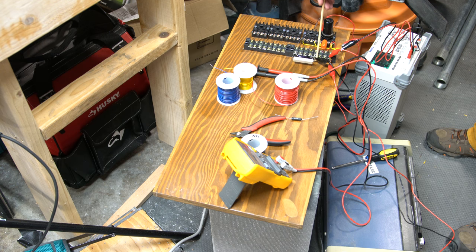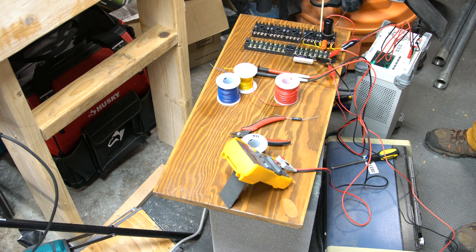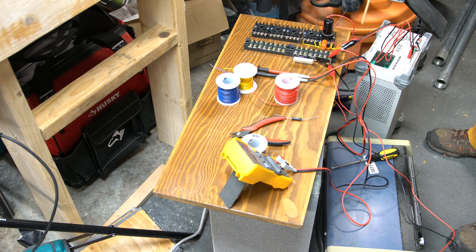I also have a capacitor connecting to the ground of the high voltage power supply. The high voltage input connects over to the plate. I also jumper that with a screen resistor across and around to what I think is pin 6. Pins 7 and 2 are connected together to supply the 6.3 volt heater. There's also a coupling capacitor coming across.